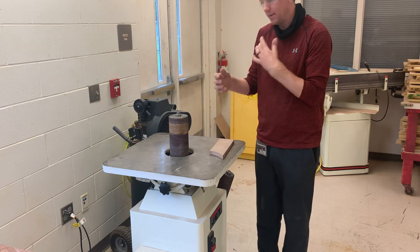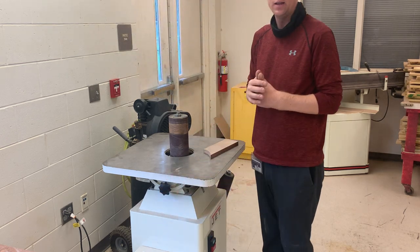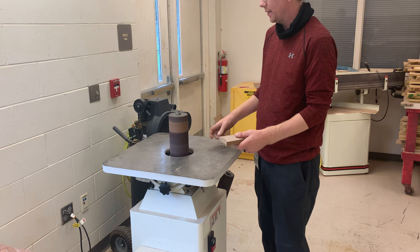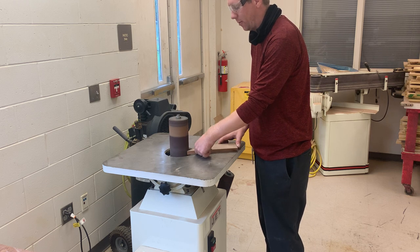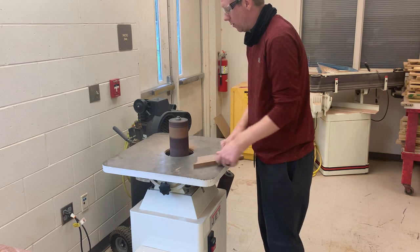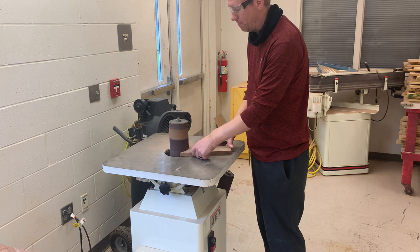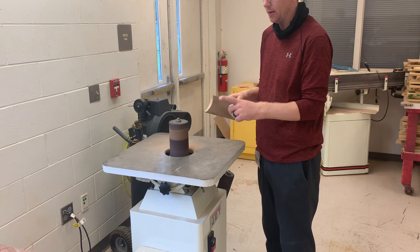I have my wood stock. I have nothing hanging or dangling from my neck, my sleeves are rolled up, and I'm good to go. This machine does not have dust collection just yet — I'm looking at adding one eventually. The oscillating spindle sander not only rotates but also moves up and down. I go from left to right or right to left, whichever you prefer. Keep the piece nice and flat against the platform — don't lift it up in the air, that's dangerous. Move your piece constantly and don't just jam it on; you'll mess up the sandpaper and your piece.